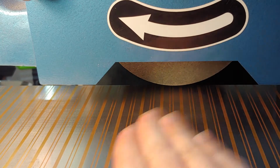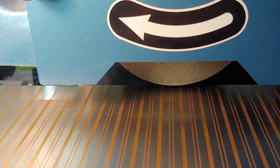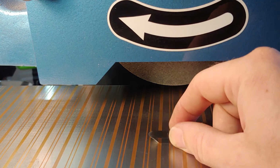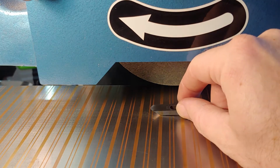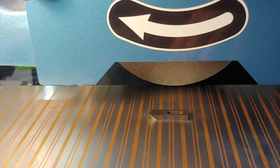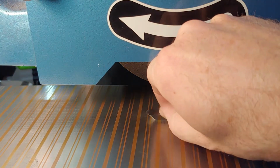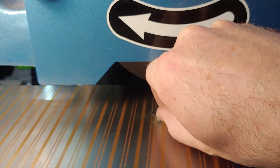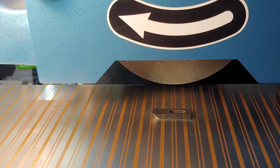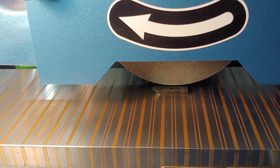So we are here at my surface grinder, and this is a really cool gizmo here. It's a magnetic chuck. With it turned off, no big deal. But if I put the blade down, and I'm going to put it in position, get it ready, you flip this little lever here, and now that's not going anywhere. All right, I've already dressed my wheel, my grinding wheel that is.